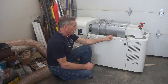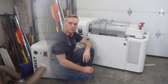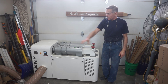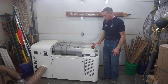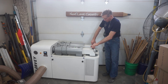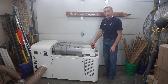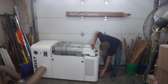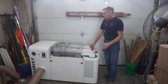There's one more really cool feature about the GyroAir G700 dust processor that I've been wanting to show you. One of the greatest benefits of GyroAir technology is that it removes 99.9% of the dust that enters the machine and drops it into the hoppers before it ever reaches the pleated filters. Turning the red knob rubs those filters and loosens the dust particles that get on there, and that dust falls into a small port at the bottom of the filter chamber. I'll spin the machine around so you can see those two ports better.